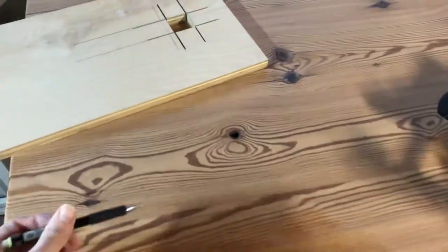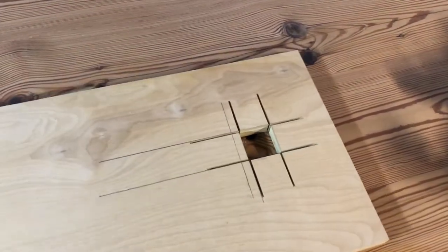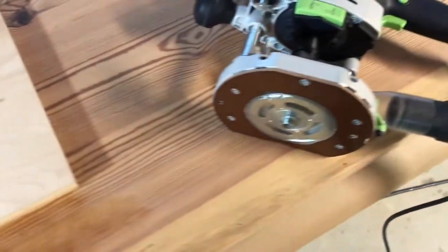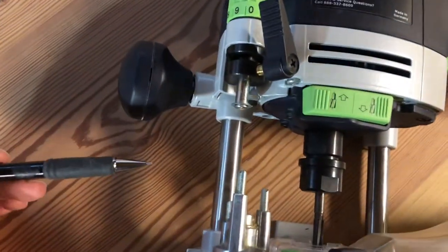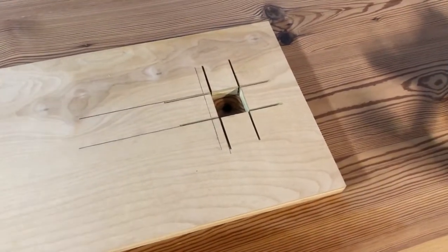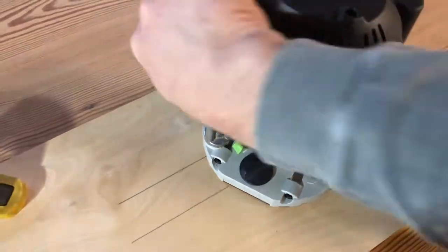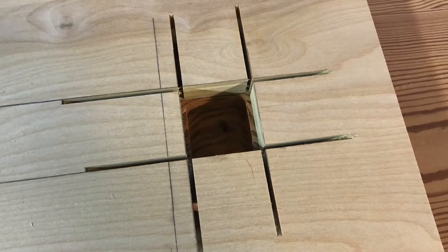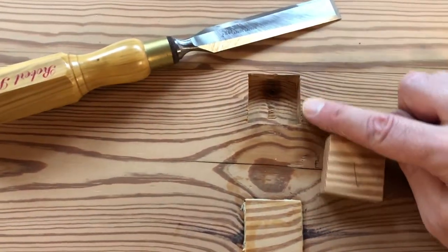Back at the workpiece — here is one of the knots that I want to patch. It's a fairly deep hole. We'll put the guide over the hole and clamp it to the surface. I've got my router set up with the quarter-inch bit and the half-inch collar, and I have the depth set as I want it. I'll route this out and create the recess for the patch. It just takes a minute or two to clean up the corners of the pocket.